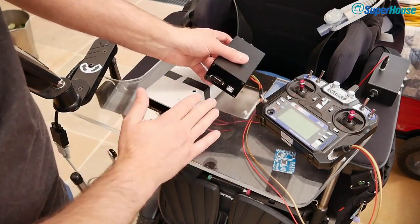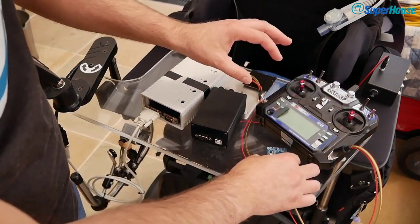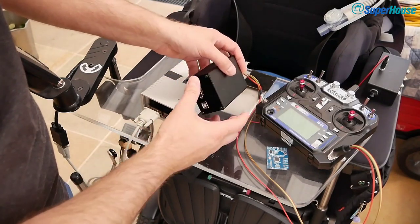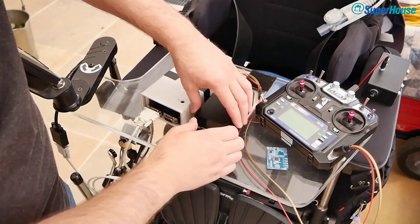By combining these two systems, we can take the chair joystick input, send it onto the chair control system, have CAN bus coming out, and send that to the FlySky transmitter. That means we can use different input devices — this one is set up for the joystick from the chair, but we could also do devices like a button box which sends CAN events, foot controls, or sip and puff controls for people that need different types of input devices. We're going to do more videos in the future showing more detail about some of these projects. Make sure you subscribe — links to both the Superhouse channel and Chris's channel will be in the video description. If you can support our work on Patreon, that would be fantastic — it'll help us keep working on these devices and make them available for more people. Thank you very much, and go build something cool. See you.